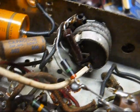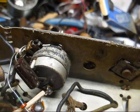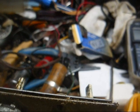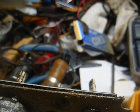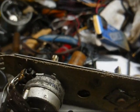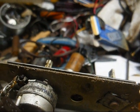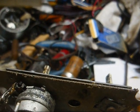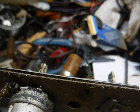All right, I'm getting some squealing at 910, which is sometimes normal because of it being double the 455 kilohertz IF frequency, but it wasn't squealing that bad before. Jumped out the AVC filter with another 0.1 in parallel with it, and that cut it down tremendously. Of course, it also cut the volume level down too.